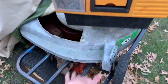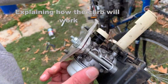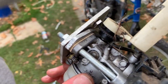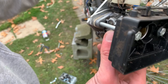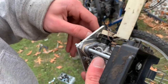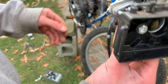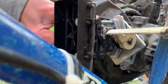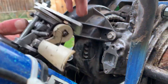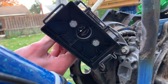So as you can see, this is off the lawnmower — the engine is vertical, it has a vertical shaft. We needed a horizontal shaft, so we rotated it 90 degrees. We don't have a problem with the oil because it's two-stroke, so the oil's in the gas. But for the carburetor it has to be oriented upright, so we had to make this adapter plate here to mount it the right way.